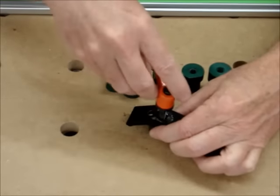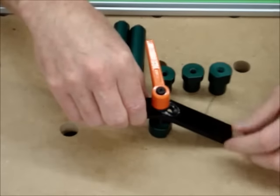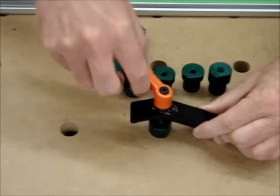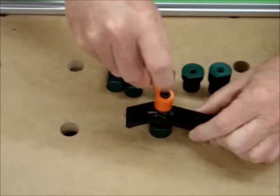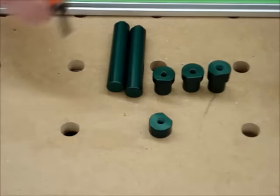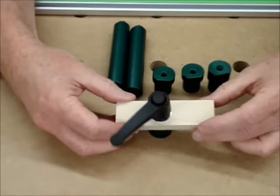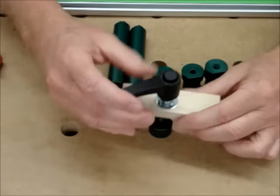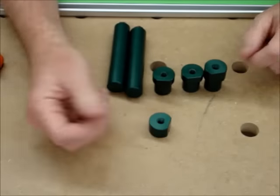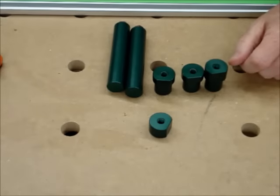Being threaded all the way through gives you thread on the top as well, giving you other clamping options. You can use an adjustable 8 millimeter handle with a commercial clamping device, or if you don't have that, you can also use a shop-made clamping element. So this gives you a lot of flexibility. The shaft fits into the holes very nicely — they're easy to put in, easy to take out, and there is minimal wiggle room.